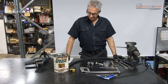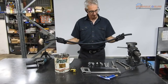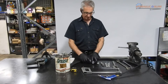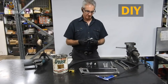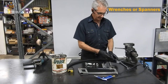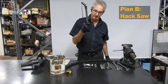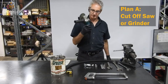As an example, we've got some half-inch two-wire hydraulic hose here, rated to 4000 psi. We've also got what we call field-fit hydraulic fittings. Field-fit means you can do it yourself with very basic tools — a couple of wrenches or spanners, or even an adjustable wrench. Some compressed air would help. A hacksaw is plan B; plan A is a cut-off saw or a grinder.